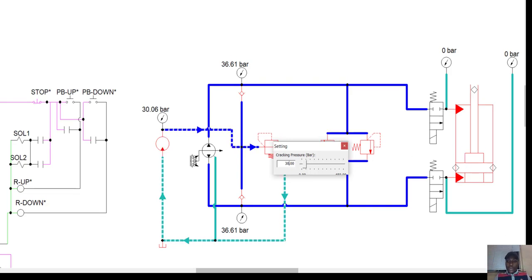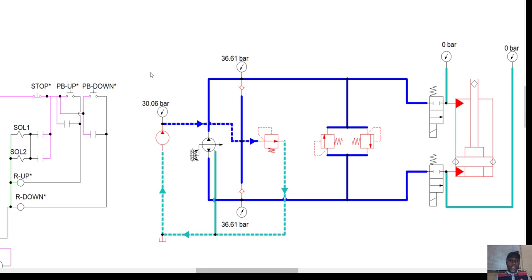We'll go back to 35 bar. Our pump is generating 38 bar but we're making use of 35 bar in our system. We can also alter our pressure limiting valve and change it to 30 bar, which is still okay. Now we'll push our button — this acts like a joystick. When we push the joystick, the swash plate will move and the valves will open. This is a two-by-two pilot control and spring return valve that is normally closed.